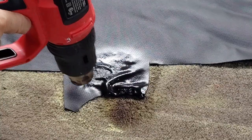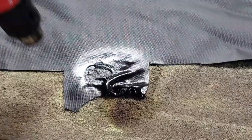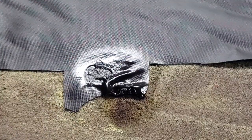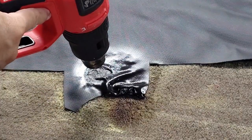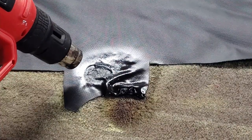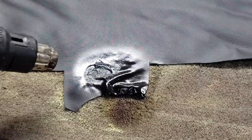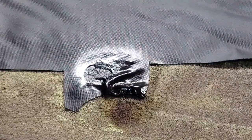Anyway, don't stop moving your heat gun — keep it moving all the time. Even if you're holding it close, as long as you keep it moving you should be okay. It's only when you stop that you concentrate the heat and cause damage.